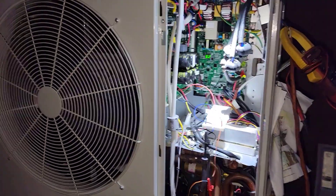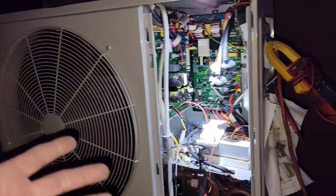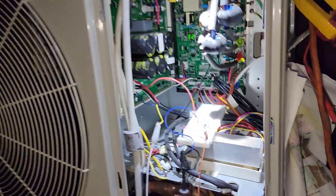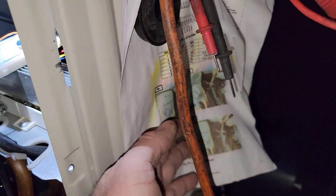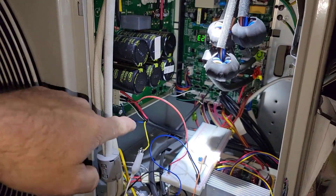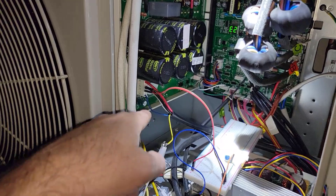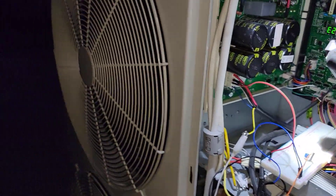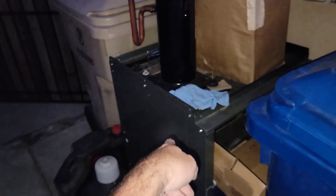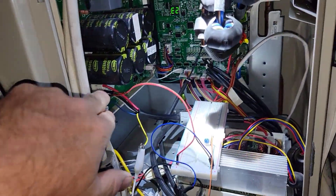I've been needing to hook this up just to make sure I could run the fan, and I successfully did it in about 30 minutes — pretty good. That's because I already printed all this out a long time ago from working on the head unit. I already figured out how all the wiring works, how the feedback signal works, all that stuff when I interfaced the carrier head unit to this and interfaced it with my Frederickson VRP. So I know how the signals work.